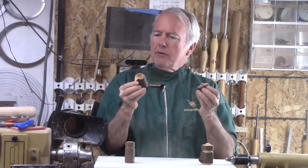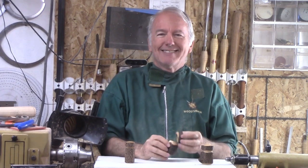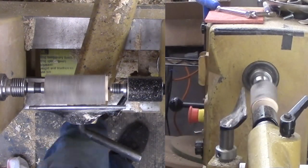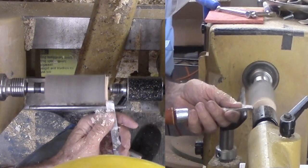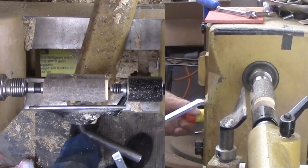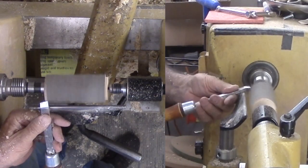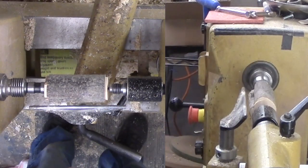How much can fit into it? It's still a box — let's turn it. This small piece of hazelnut sucker with the bark is mounted between centers. The drive center is a step center clone. I like this drive center because it has small teeth that will slip when there's a catch, rather than let the wood jump out and fly away.